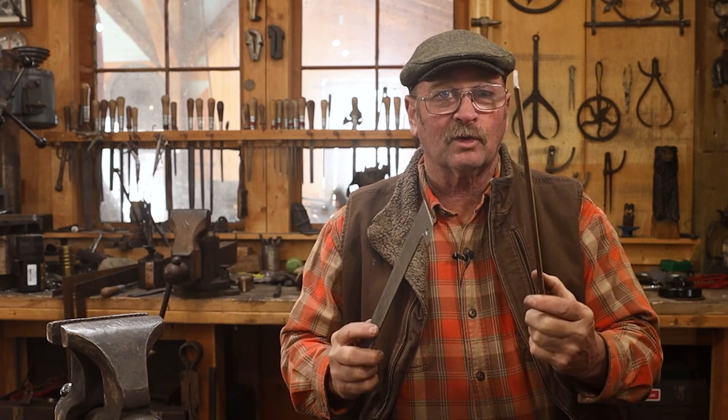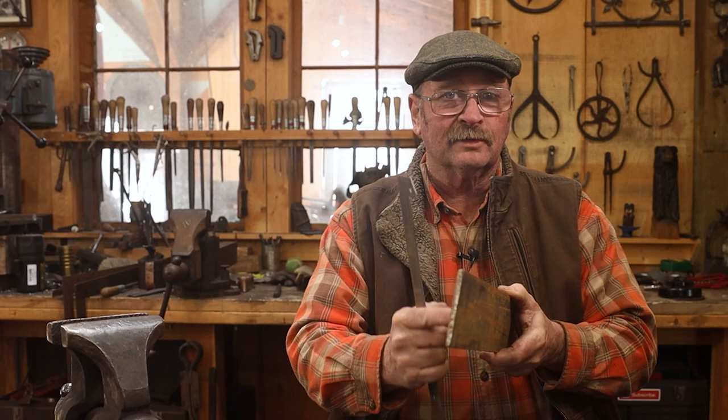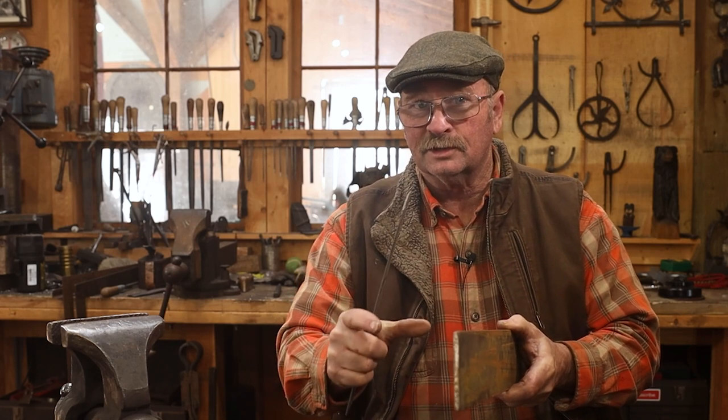Currently this book is about one inch thick, and as it fills up people are going to have to add more pages to it, so I need to leave plenty of space. Plus, as people put touch marks on these pages they're going to start to warp and twist a little bit and each page may take up a little more room. These are about three-sixteenths thick right now so you can put a nice deep bold touch mark into them. I'm going with a piece of quarter by three for the spine, and it will get some sort of a U-bolt to serve as the loose-leaf that'll have to be unbolted to change the pages.